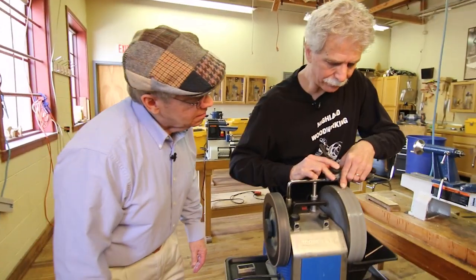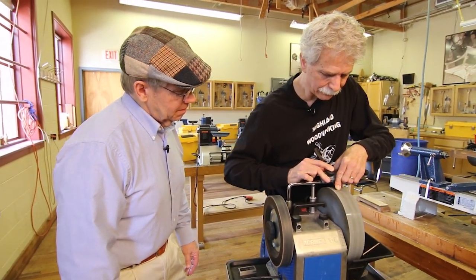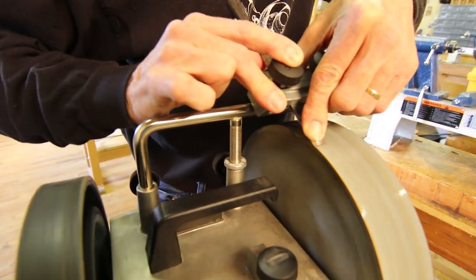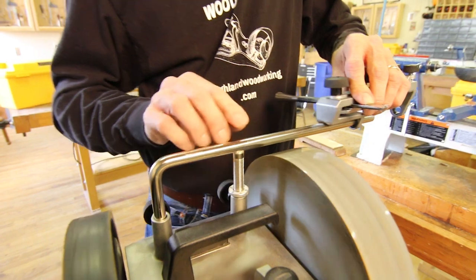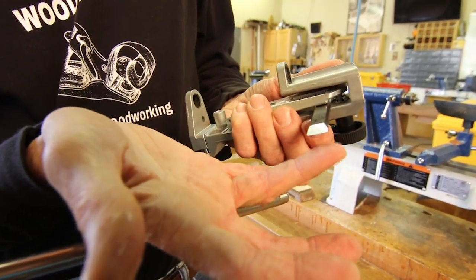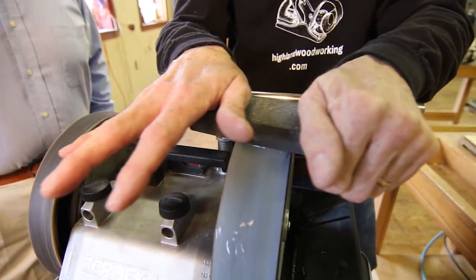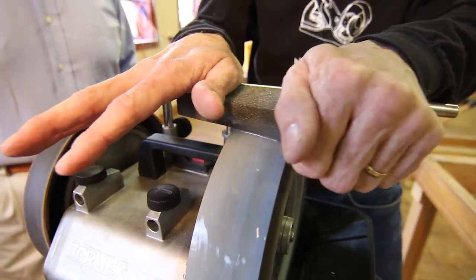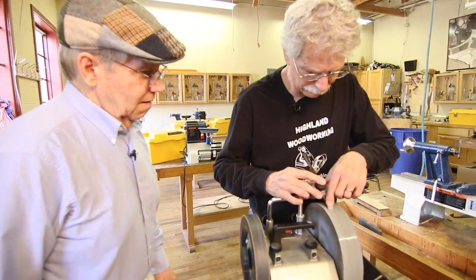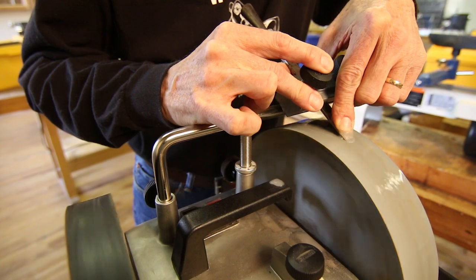This wheel is grinding at about 220 grit, and when I get to a place where I'm happy with the grind, I'm going to dress the wheel with the stone grader that Tormek includes for this unit, and it'll put it at about 1,000 grit. And I can feel the back and feel that I have a burr all the way across. Takes just the outside circumference of the wheel ever so slightly, and just for about 30 seconds. So now you're just polishing that out. Yeah, a little bit finer scratch pattern.